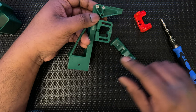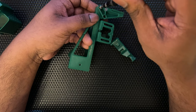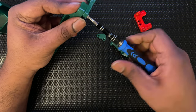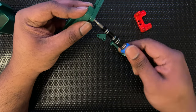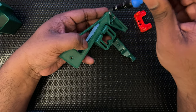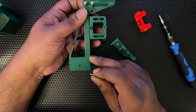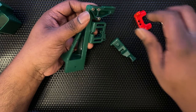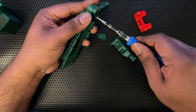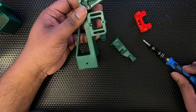I have a really horrible first layer on all these prints. All the green parts suffer from this because I forgot to change my offset settings before printing them. The problem is that because the first layer wasn't as close as it needs to be, there would have been uniform under-extrusion on all the walls, which could cause the parts to be a little weak. The same is likely true for the Z-drive module parts. If they break, we can always print new ones.